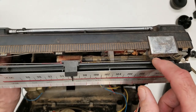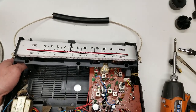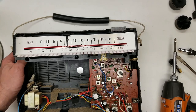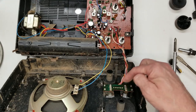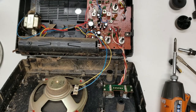I see a pretty good sized ferrite rod antenna for the AM. It does look like they're using some higher quality components for the tuning, coils, and whatnot. It doesn't look too terribly bad. I'll have to check the sensitivity of it. It's kind of strange that they opted to have the switches not be attached to the main board but way out here. I'm going to go ahead and clean those switches - they're really hard to operate.